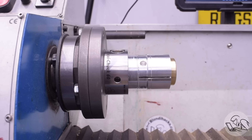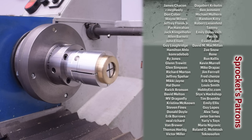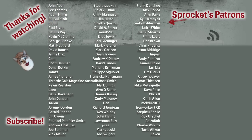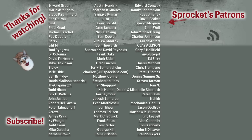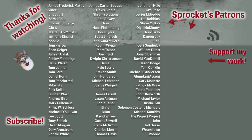Or frankly, you could just weld or bolt your own new chunks of aluminum onto the front. As long as you preserve the thread and the taper on the base, once the split section is getting a little bit low, just graft your own new material on the front with those split lines in it, machine it down, and you're back in business. So I think this thing is going to last a really long time, especially given that it's a pretty special purpose kind of tool — just for those weird, delicate little parts where it's difficult to hold on to them any other way. Really cool tool; I'm excited to use it more. Watch for it on my channel. Thank you very much for watching, thanks to my patrons for making all of this content happen, and I'll see you next time.